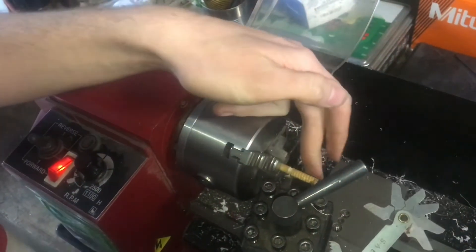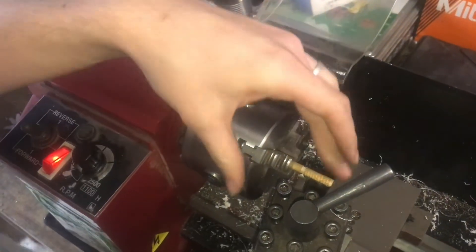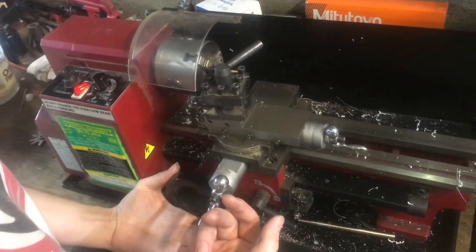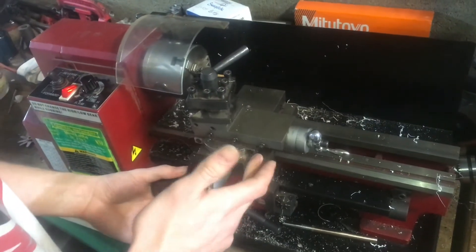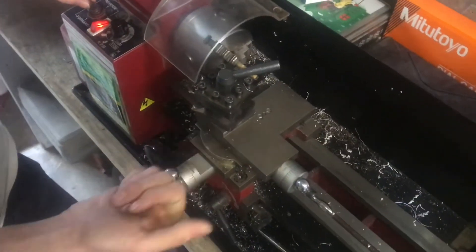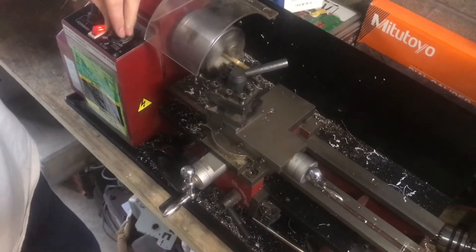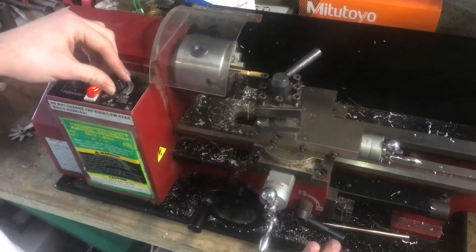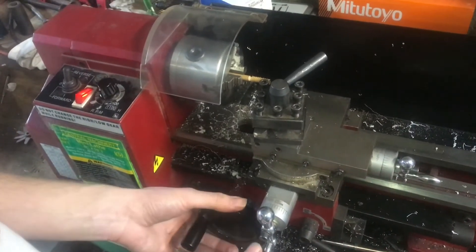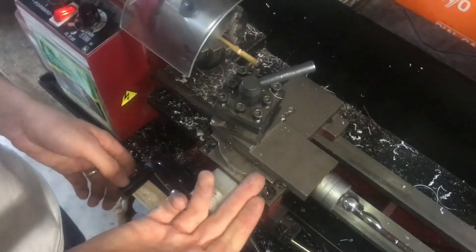12 threads per inch is a little bit unreasonable for something of this size — this isn't a standard thread or anything, just a demonstration. On some lathes you might have to pull the half nut lever up and then move your Z-axis back to the starting point. But in this case because we can go into reverse, I just retract on my X, switch it into reverse, keep the lever engaged, turn on the spindle, and back up. We don't have to pull the lever up and risk being a little bit off on the thread dial — we can just go ahead to a little bit more depth of cut and take another pass.